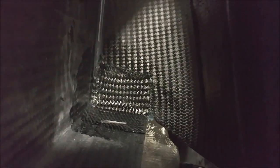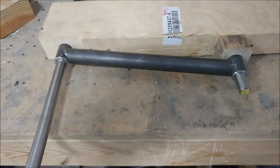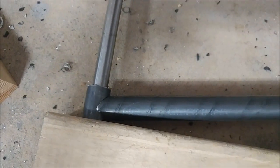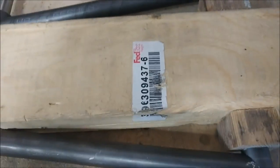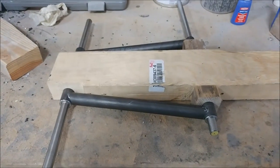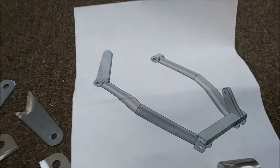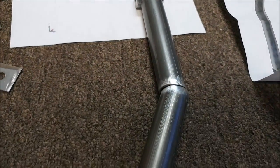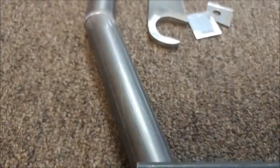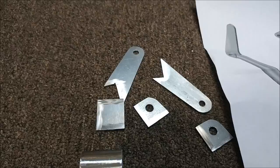We're still working on some last-minute changes to how the control systems work before we start putting the roof on. I've been pretty busy getting all the pieces together for Brit for the nose gear retraction system. I created a little jig for him so he can weld the pieces into place — one for the upper part and one for the lower part. I cut all these pieces by hand, cleaned up all the ends so they're ready to weld, and created fixture jigs. We didn't use the laser cutter this time since it was busy with the main gear parts.